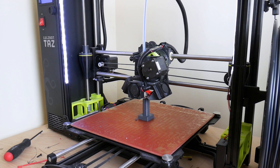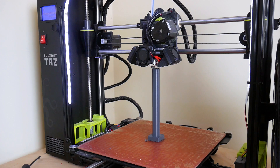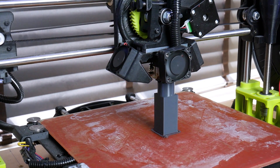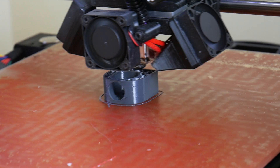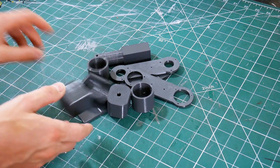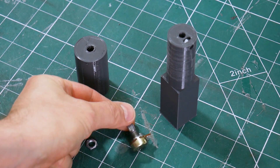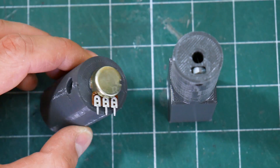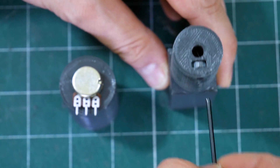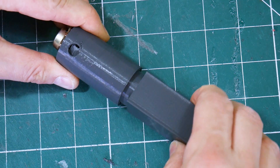So I 3D printed all the parts - these are just in PLA. I did a couple of revisions to get the tolerances right on the joints, because we've got a piece which fits inside a tube typically on each joint and holds a feedback potentiometer. I'm using normal linear 10K feedback pots - each one fits in the end of a tube, and there's a grub screw on the piece that goes in with a captive nut, making a joint with a pot on the end supported by the plastic tube.